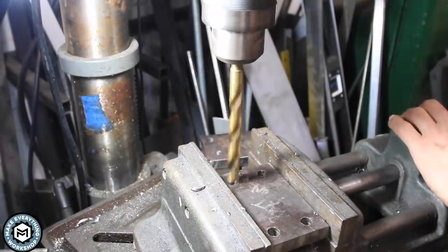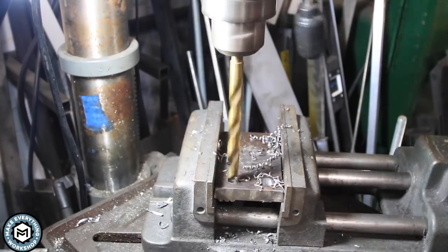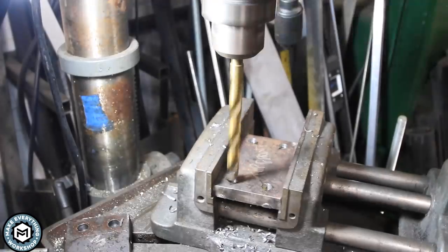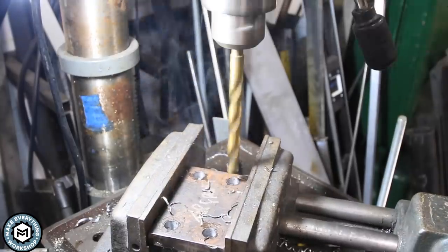I go over to the front side of these plates and drill them out to the seven-sixteenths hole for the hardware. On these I didn't oversize — I went with seven-sixteenths as the drilling size. I wanted to keep these as tight as possible and figured if I needed some room for slop I could always make the holes a little bigger as needed.